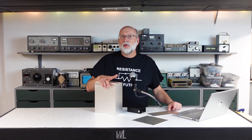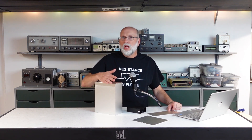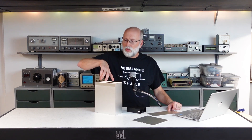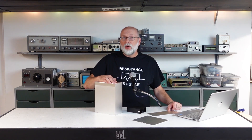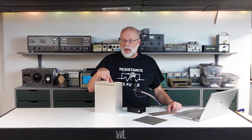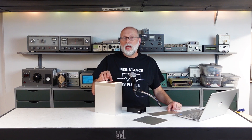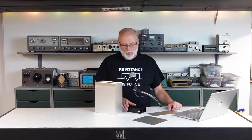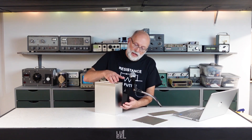The next topic is the case I'm planning to use — this is the case I bought off Amazon for the receiver project but realized was just way too big for that. It's 100 millimeters by 205 by 250, and it's a very good appropriate size for this transmitter. I've got big things to package, including the final power amplifier board and a boost converter because I need 28 volts, boosted from 12 volts. I also have heat to get rid of, and I have this heat sink salvaged off a $5 HamFest special — it'll fit nicely on the back panel.